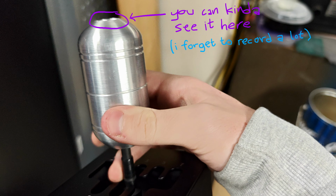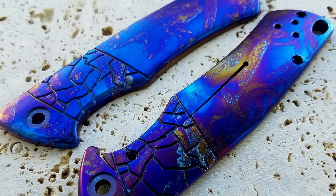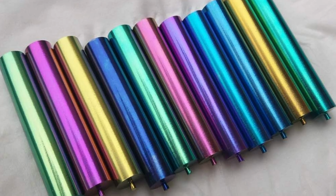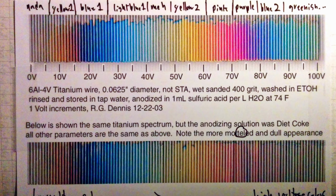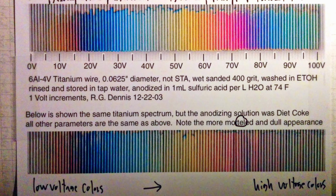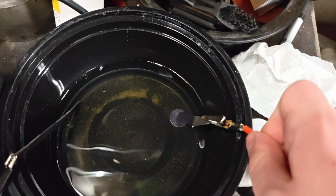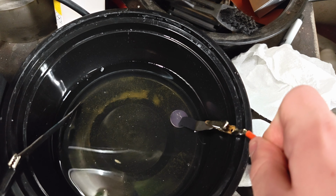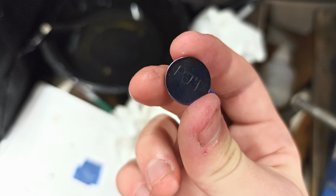We had bored out a shallow hole at the top in order to inlay a small piece of titanium. The fun part about titanium is that you can anodize it to be pretty much any color with some electrolyzed water and a high voltage DC power supply. The surface of the titanium changes color depending on the highest voltage that is run through it and for how long, so I was able to anodize it purple, scratch out my channel name, and then anodize it again at a lower voltage to get a different color. The contrast didn't turn out amazing, but at least I know it's there.